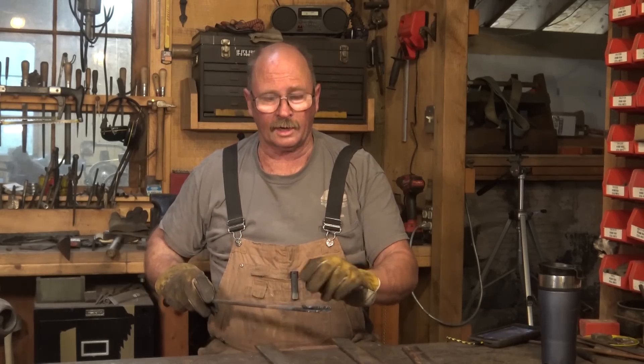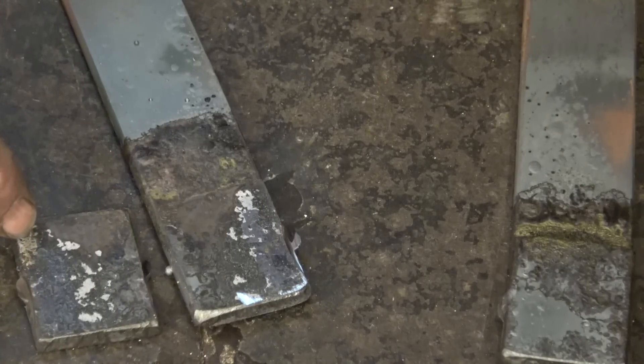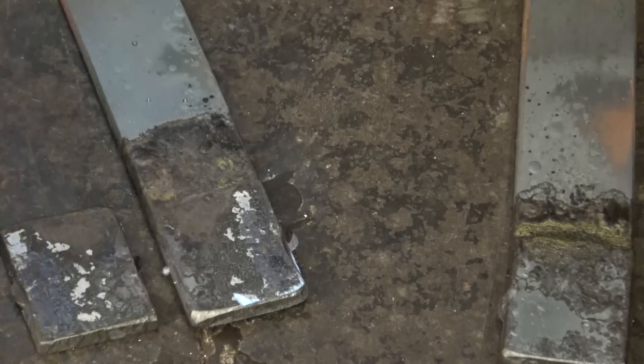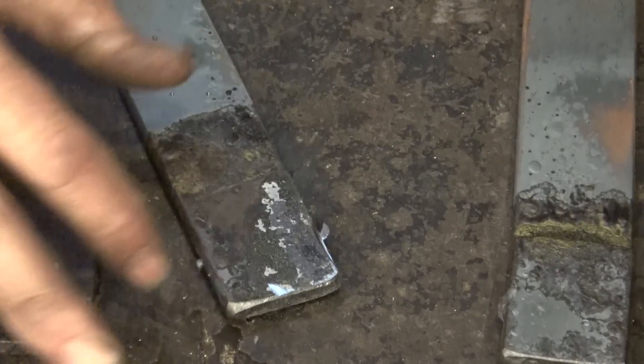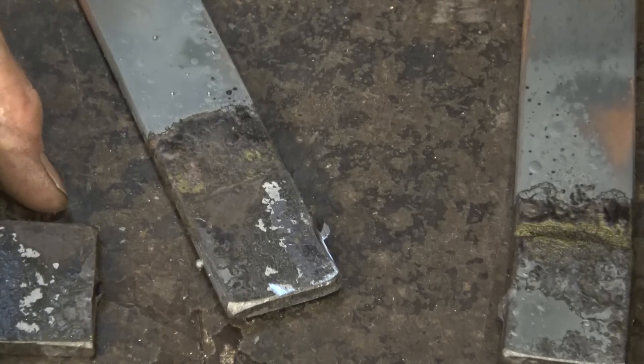We have our sample pieces cut apart — let's see if this actually tells us anything. The first piece is the one that was just borax, put on right at the end. When I open this up there's some sort of a layer here — it's turned white in some places, but it wasn't white before, so I think that's still just a thin layer of borax. It looks like it may not have flowed quite as evenly into one corner, but other than that it got pretty much all the way down in there. So if I had fluxed lightly along the edges, this probably would be entirely fluxed at this point.